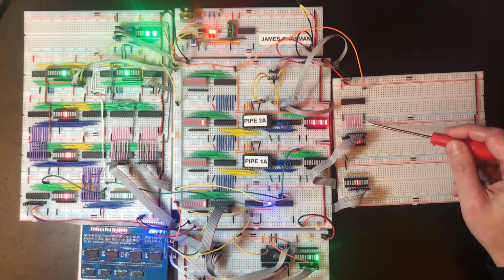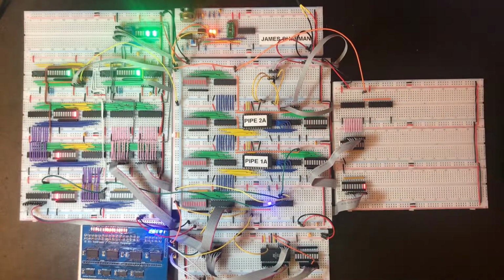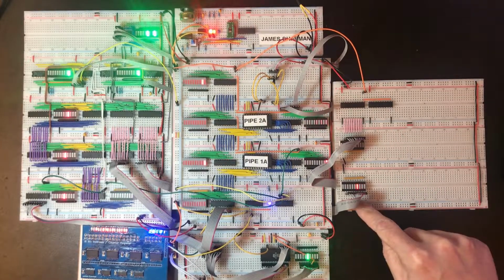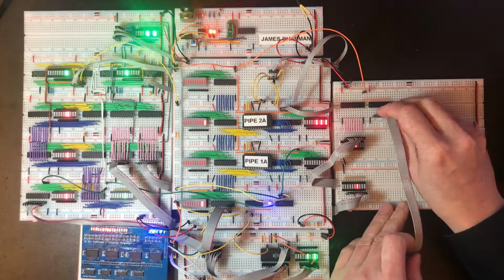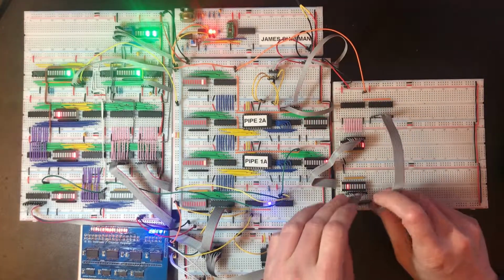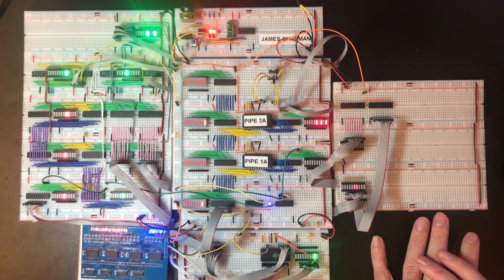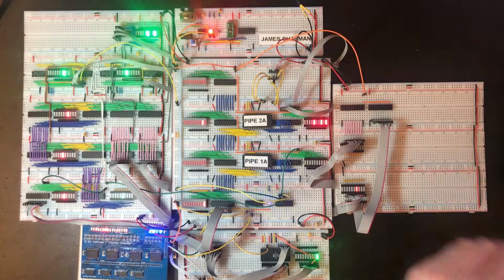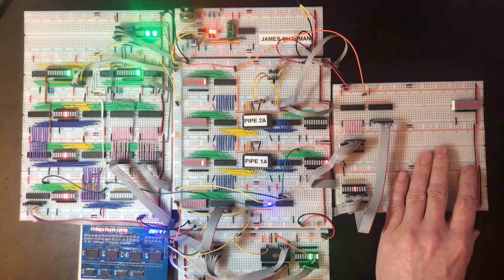Okay, so these pink lines are basically a stand-in for the shift unit, and we're going to need a second latch. It's going to be a bit more difficult to bring the wires all the way up here for the right-hand side input. I'm going to shortcut it with a DuPont cable. These connections are only temporary after all. I doubt we're going to get as far as putting the values back onto the bus from the addition, so I'm going to stick some result LEDs in. I think it's probably a good idea to have those anyway.